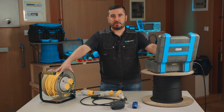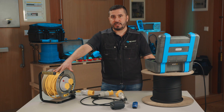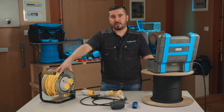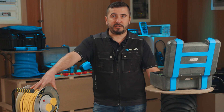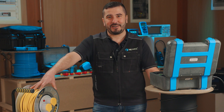Each examination of electrical equipment must consist of a thorough visual inspection, which is in some cases the only applicable test option. Because we are testing a cable reel, we would have to unwind it completely and visually examine it throughout the whole length, as some damages cannot be found through electrical tests but can be found with visual inspection. For this video, we will make a small exception and pretend that this first part has been carried out accordingly.